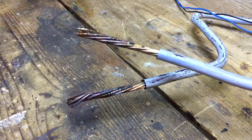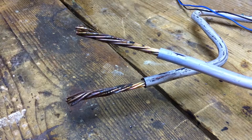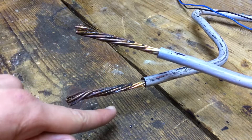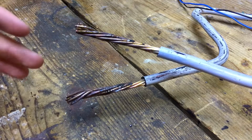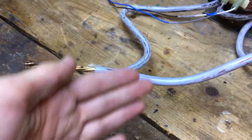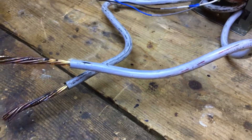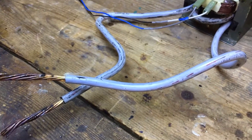After doing all that, these output leads — ow! — aside from being still very hot, have a lot of black residue on them, and some of that white smoke we saw when I melted the large bolt. But the good thing is these leads are so long that I can just snip them off and strip some insulation to expose some new copper, still with plenty of distance from the actual transformer.